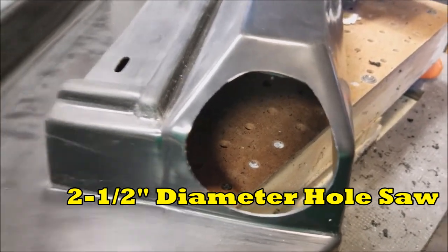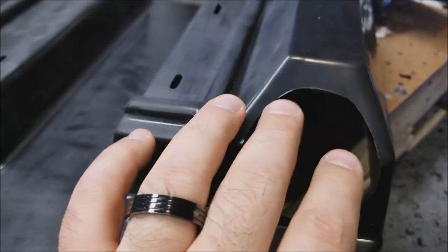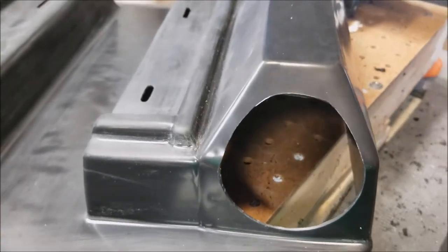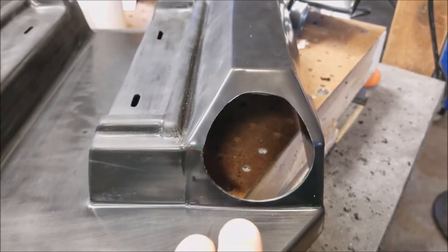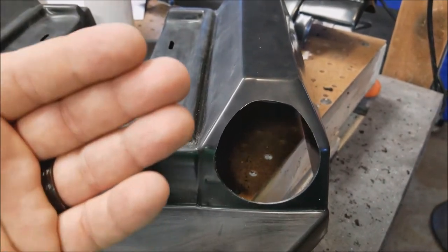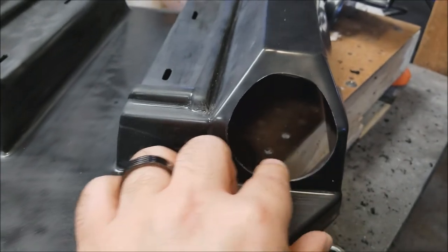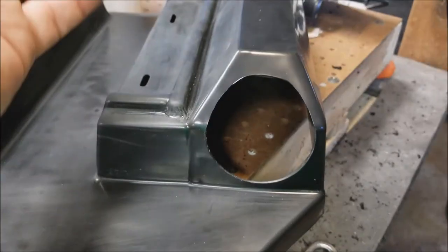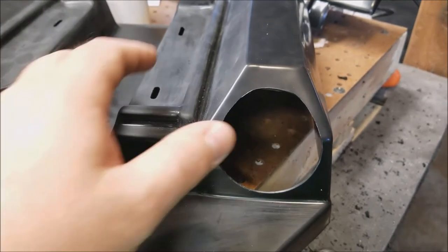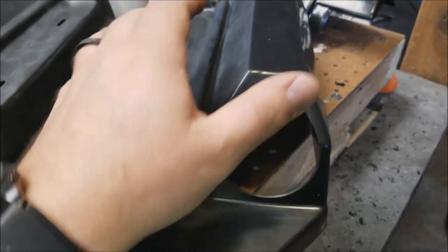Before, what we would do is we would draw lines along here, and you'd kind of have about a quarter of an inch edge around this tank area, and you'd end up with a trapezoidal type shape that the pipe would sit in, but it wouldn't sit snugly in. And so we developed the foam gaskets that we send with the kit that you put on the inside, and it fills any gapping there is around the pipe. So it was a good solution. It made it pretty forgiving. We still send those out with every kit in case you muck up the trimming around those.